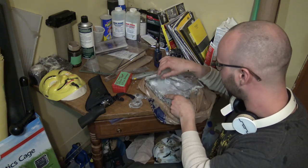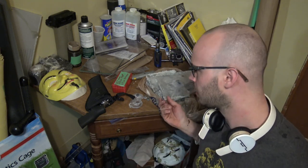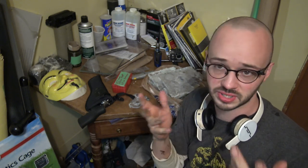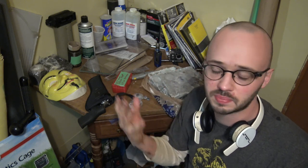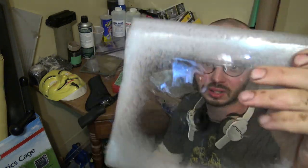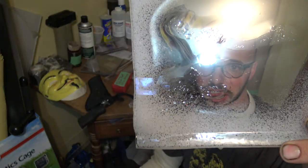It did lose transparency after the very first shot. I think if you changed the thickness of the glass or the polycarbonate you might reduce that. Using a better grade of glass — mine was the cheapest available at any hardware store — like shatter-resistant glass might hold together better and stay transparent longer. Also something to watch out for: this piece of polycarbonate I didn't fully dry, and when I started to laminate it you can see how it rippled in the middle. I also got it too hot, close to its melting temperature of 400–500 degrees.